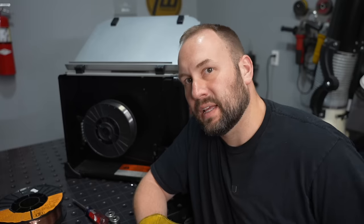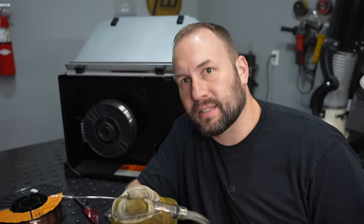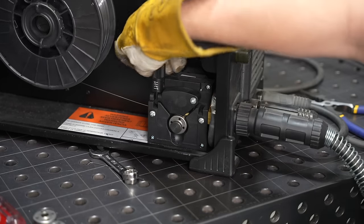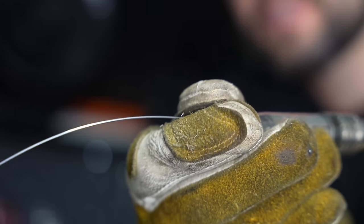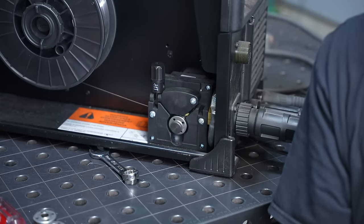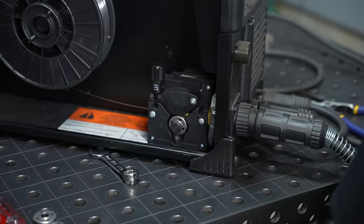Let's revisit the idler tension on the drive feed mechanism. A lot of times it's way tighter than it needs to be, and there's no reason to put that extra load on the components. The textbook method for solid wire is to push wire against a piece of wood and have it curl without slipping, but it's easier to just use a glove finger. Pull the trigger and check for slippage. On this machine, around setting number two is usually good — when I pinch the wire it just pushes through and continues to feed, so I know I'm good. Don't go any tighter than needed; much looser than you usually see is the right call.